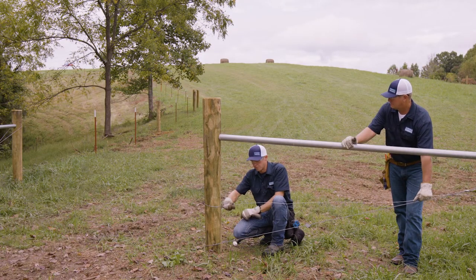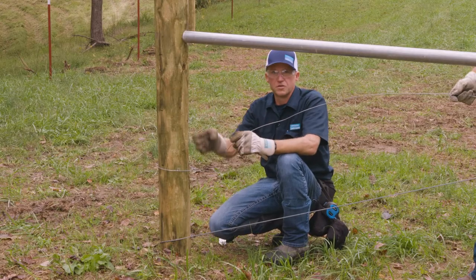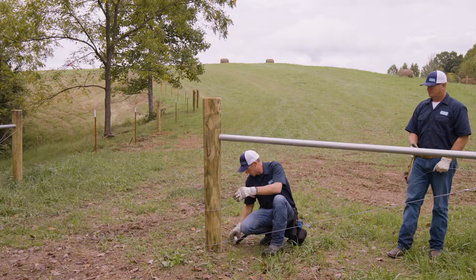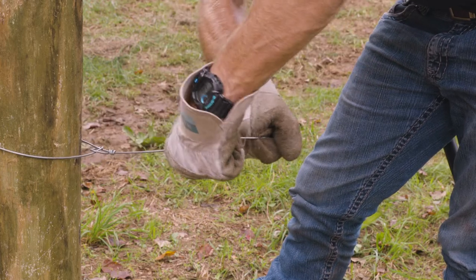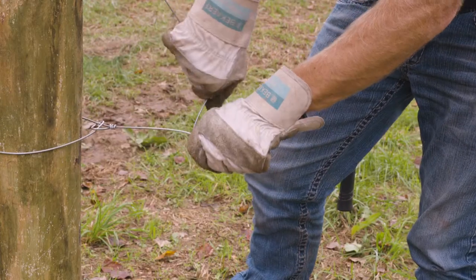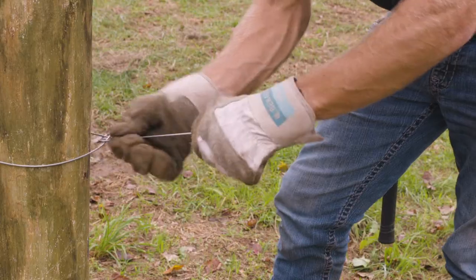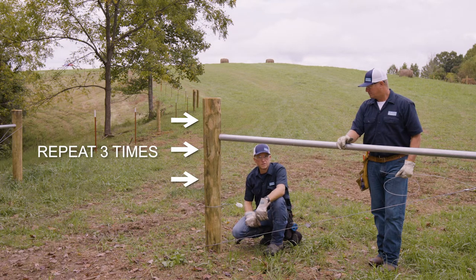What we like to do is get pulled up against the post, take two fists and put a bend in that wire — that'll be our cross point. If we do that all the way up, you'll have a really nice looking fence that runs straight up. We're going to cut our wire and leave us a tail. Now with the bend up, we come down and do a tying wrap right here. With this wrap you want to put about four to five wraps on — that'll give you plenty of wrap to hold. Bend a handle in it, straighten it out, come up and use that same crank method to break that wire off. We'll repeat this process for the next three strands, then start bringing our wire in and terminating and putting tension on it back to the far end.